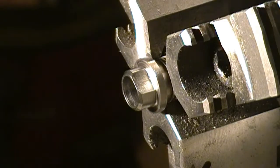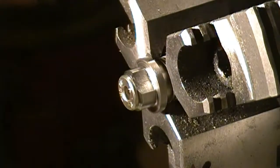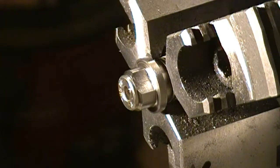What I did is I drilled it out in steps and then reamed it in. I first drilled it shy of around .370, then reamed it out with a one-thousandth under reamer, which left it at .374. I then turned around and used my one-thousandth over reamer, reaming it another two-thousandths to .376. I took it and put it in my Gonic barrel with a CCI small pistol primer and she went off like nobody's business.